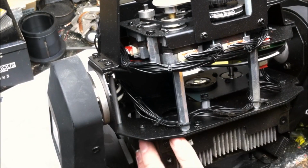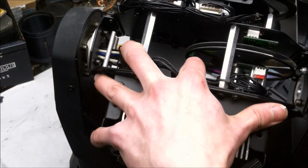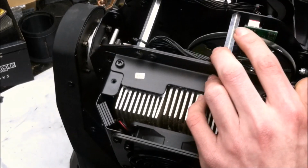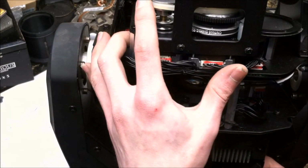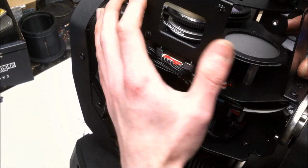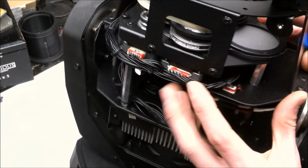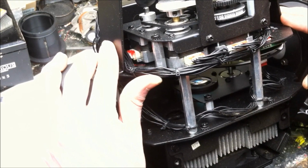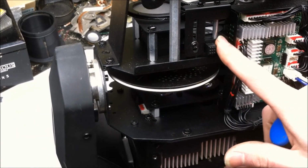The LED, the focus assembly. No, not the focus assembly. Stationary focus lens, magnetic Hall effect pickup, dichroic color wheel, a magnetic pickup for that. Got the steppers. Looks like the stepper is for moving the trifocus apparatus. Looks like we got a kind of frosted blurring optic, and underneath that, is that a focus assembly at all? No, maybe we don't have a focus. Oh, maybe we do. Yeah, we do. Okay, spin this around. I see it now. So we do have a focusing assembly right here.